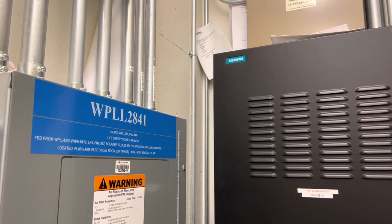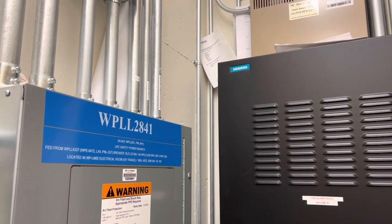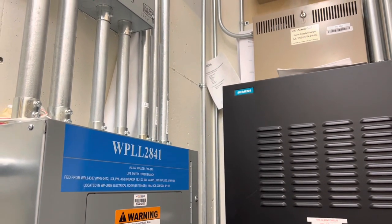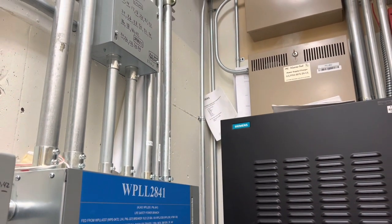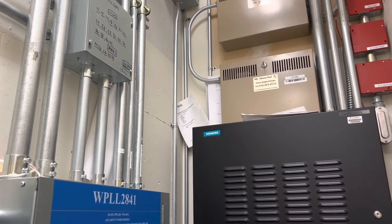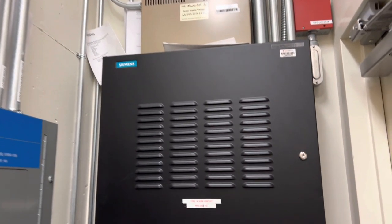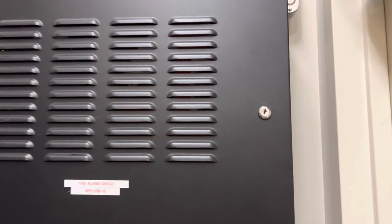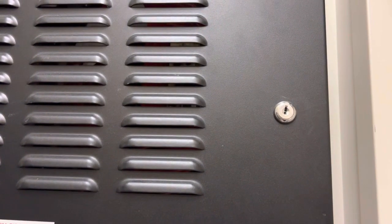So I went over to the fire alarm closet, unrolled the wire inside the panel. If you guys remember this room, this is where I've done some work before — shutdowns, mounting boxes on the wall, pulling wire. This is a life safety slash fire alarm closet. I opened the fire alarm panel up, unrolled the wire bundle on the left, and did my fire alarm testing with the electrical meter — the Fluke 117. I did the ground fault testing, the continuity, and a couple others.